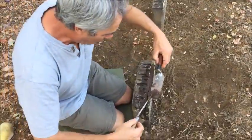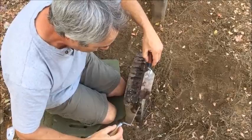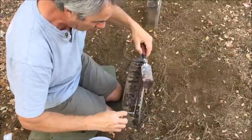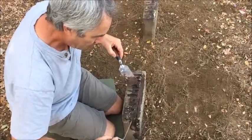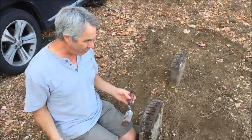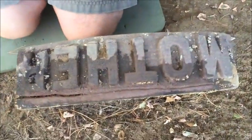I'll keep going here and we're going to fill the top of this in. Trying to work it in as deeply as we can without causing it to break apart from the pressure being exerted on it — and it's starting to fill up. Sometimes this can be a little messy, especially going up a corner; it's more tricky to work on verticals than horizontal joints. We'll take a break for a second and come back. Okay, we're back and we're going to finish up the filling of this void from the delamination. This is again a brownstone tablet-style footstone marker with raised lettering — it says 'mother' on it, and it was pretty badly delaminating in the back area.